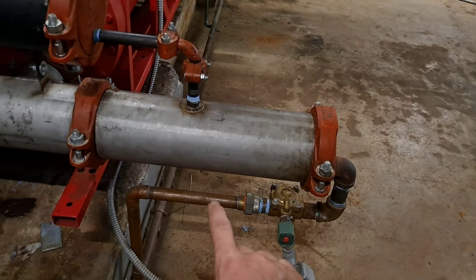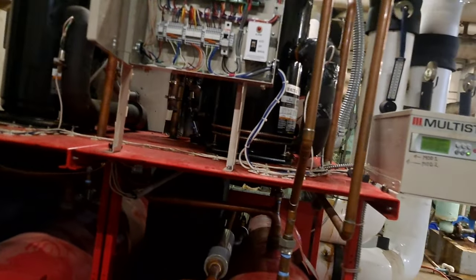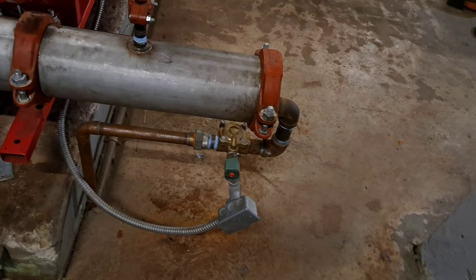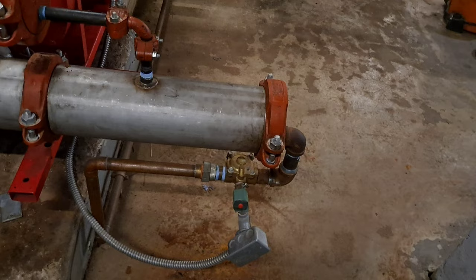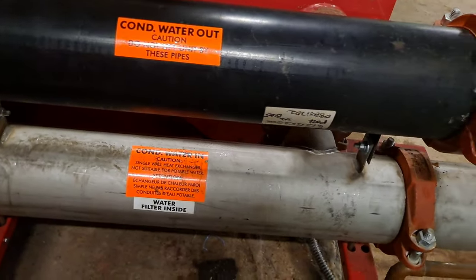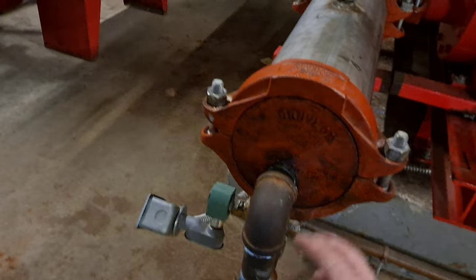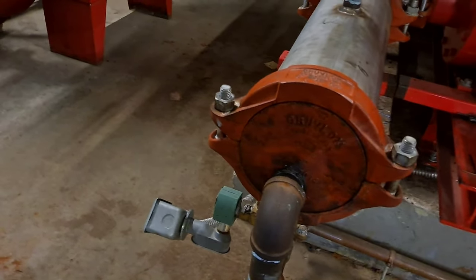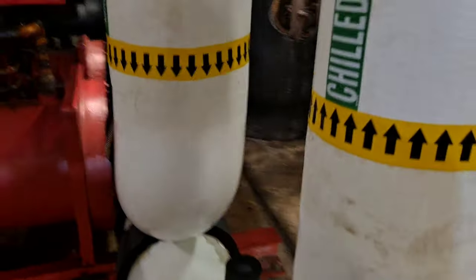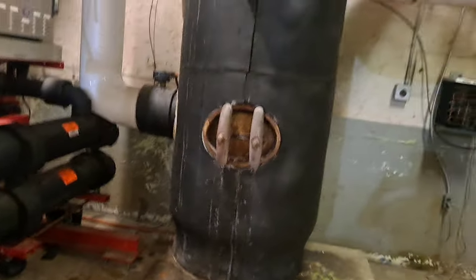This right down here is kind of a cool feature — it's called a multi-flush. What it will do is at a certain time every single day, it'll activate the solenoid and flush some of the junk that has accumulated out. It works pretty well. Inside this bottom one here where it says condenser water in, that is where the 30 mesh strainers are. You have to remove all of this, pull the end cap and the collar, then pull the basket strainers out and clean them, put them back in. Same thing with the evaporator over here — this is the other side of it. They're also using a buffer tank here.